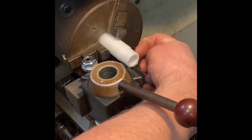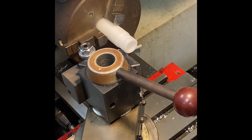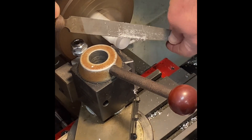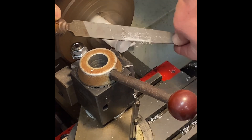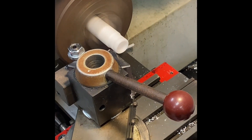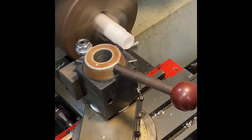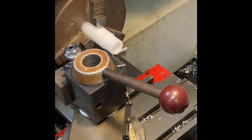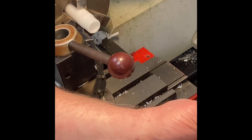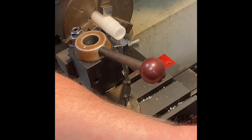That looks pretty good. I got a nice little chamfer on there — took a little bit more on this side than the other side, so this is hand finishing. I can go back and hit the other side. Make sure you're at 45 degrees when you're filing. There you go, that looks pretty good. Now I'm going to go back in and part this off all the way, but I don't want this to fly off by itself, so there are different ways you can accomplish this.